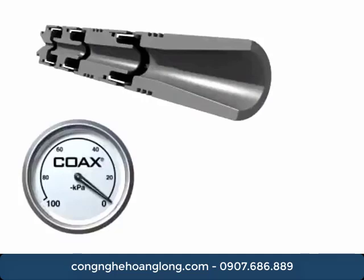At roughly 20 kPa, or 6 inches of mercury, the largest nozzle cannot continue to develop any more vacuum. As the other nozzles create higher vacuum in the system, the flap valve for the third nozzle closes. The second flap valve will close for the same reason roughly at 40 kPa, or 12 inches of mercury.